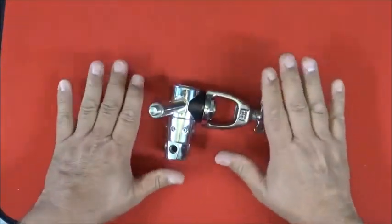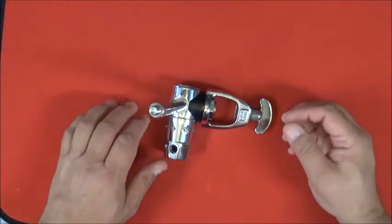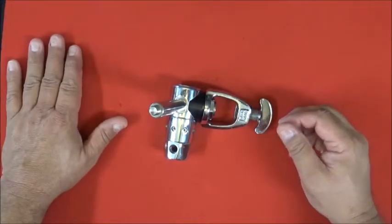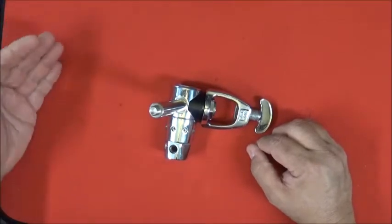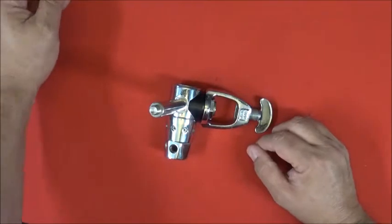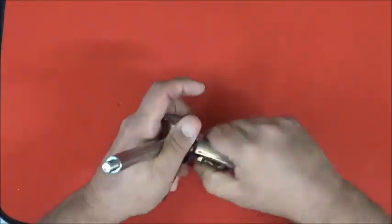Let me stop and say — I even made a note for myself to say this but I didn't. As you're starting to take parts off of it, I think it's a good idea to print out the schematic. Then each part you take off, especially the O-rings, just lay it over that part on the schematic so when you go back to put the parts back in, it'll make it a little easier to remember things.